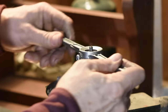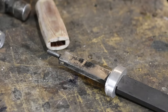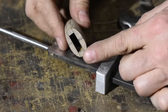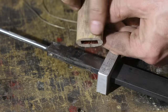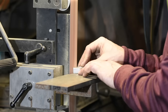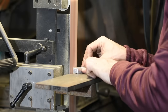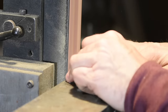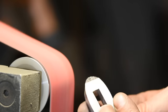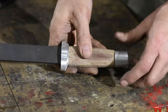After cleaning all the flux and crud off the extension, I'll thread it with a threading die. Once that's accomplished, I'll finish the component parts. We're harvesting the handle material from the previous handle, this time finishing it correctly so that it mates properly into the guard. Same goes with the guard, which will be marked to mate with the micarta. After we've got everything shaped properly, we'll fit it together, thread on the pommel, and blend everything on the grinder.